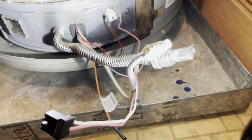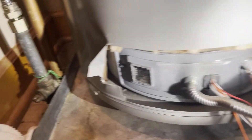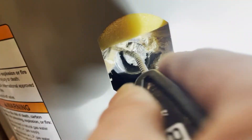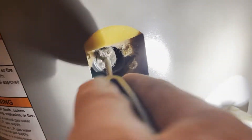The old valve is out. We've got the lines all sitting there, the gas is off. When we talk about draining this heater, that's the reason why — we don't want water coming out and getting trapped back in here rotting things out. Now I'll show you the next steps. Use your wire brush to go inside and clean the threads so there's nothing in there. I've got a little bit of fiberglass tucking its way in there and we don't want any of that caught up in the thread work before we reinstall the new gas control valve.